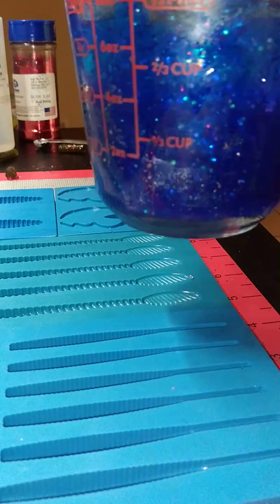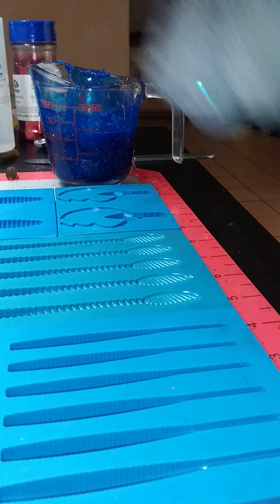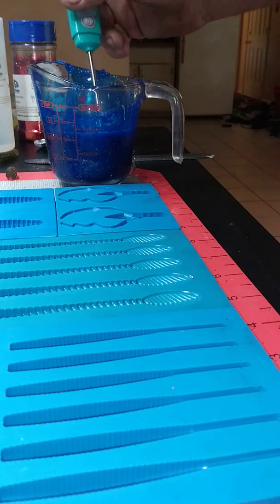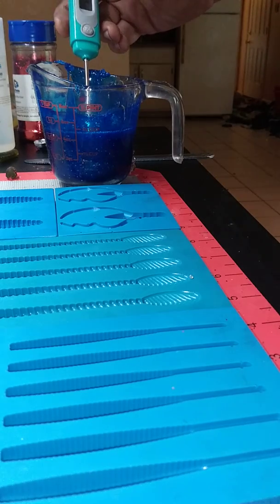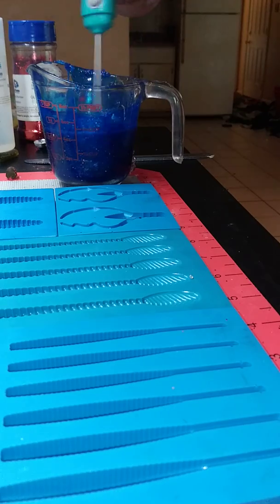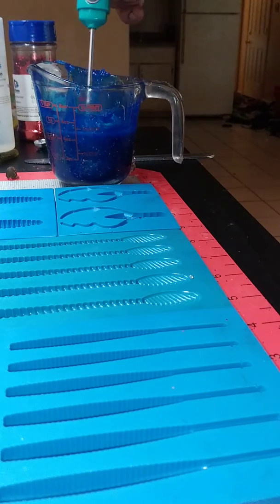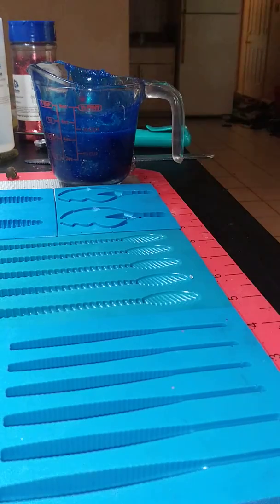You can get starter kits, you can get glitters. This is a color we're pouring right now. So I can tell that's about 350 degrees. And put this in there just to check. Just checking my thermometer. I actually have my infrared holding my phone up right now. So yeah, we're about 340. That's why I like to start pouring.